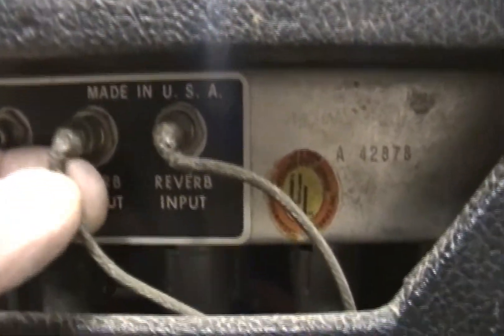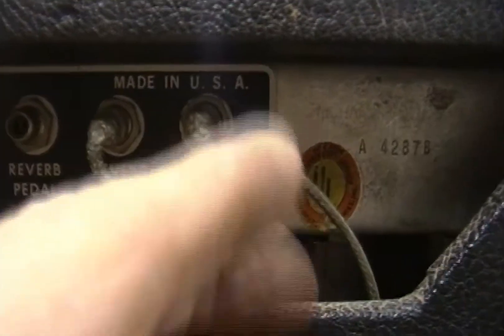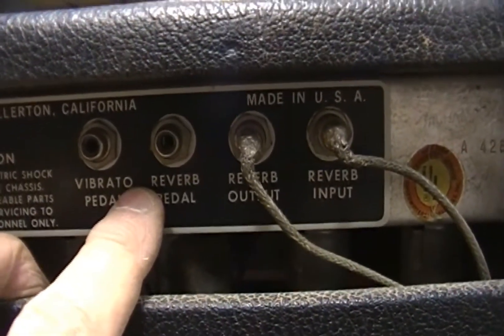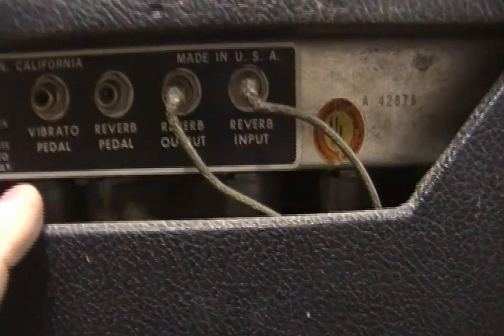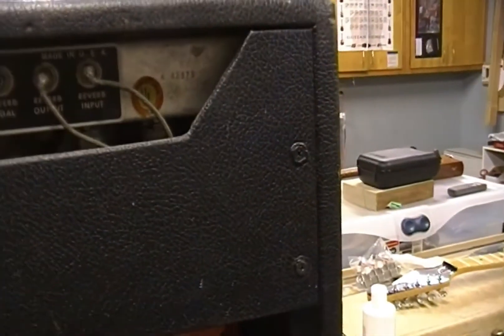These ground tabs are loose on that one, and this one seems okay. I'm going to re-solder or replace the ends on these — I wanted to try to use the originals just to keep it as stock as possible. You've got shielded wire that solders to the outside of the housing and the inside wire solders to the inside pin. I'll have to pull the pedal back out — it's been buried in the bench for months. I may have to pull this back panel off before I know what tubes I need or what type of circuit it even is.